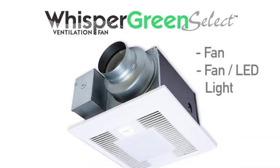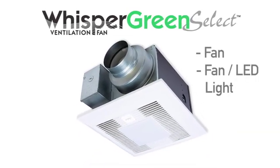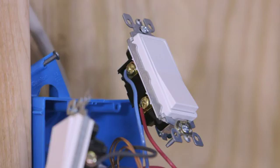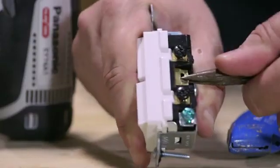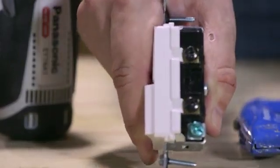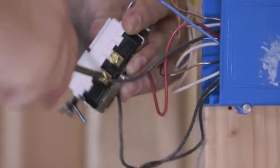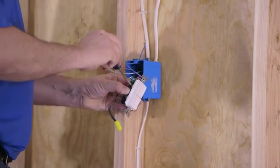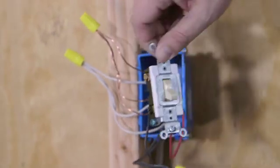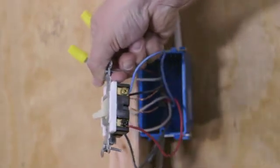When wiring a fan light model, you will need a separate circuit for the light switch, as you cannot supply line voltage to the red wires. To wire a fan light, you can use two separate single pole switches and run separate circuits for the light kit and the signal loop for the fan motor. Or, if you prefer, you can use a single pole over single pole switch, breaking the common tab on the line side of the switch — use one switch to control power to the light and the other to control the signal loop to the fan motor. If you would like one switch to turn the light on when you turn the fan on or to its boost mode, you can use a double pole single throw switch: use one pole to control power to the light kit and the other pole to connect the wires for the signal loop to the fan motor.